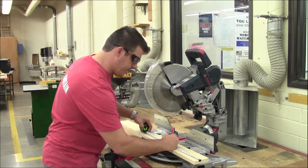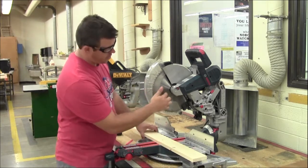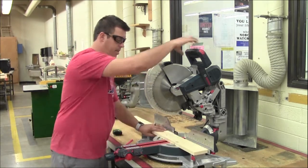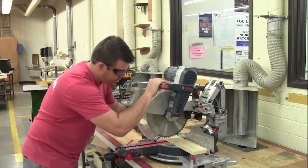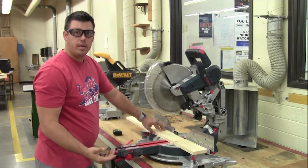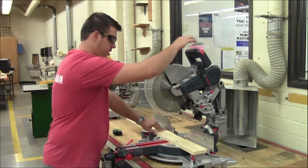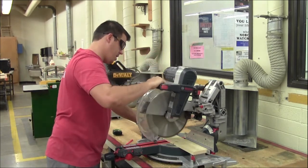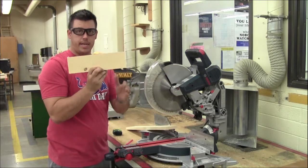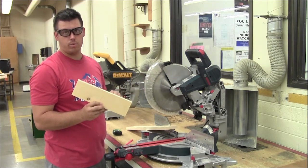One key thing is I'm measuring from the right-hand side of my piece of wood. I need to cut with the right edge of the blade even with the mark that I've made. I'm going to adjust my piece of wood until the kerf of the blade matches my pencil mark. Now I'm going to cut again — firmly down up against the table and up against the fence. Now I have my 12-inch piece, 90 degrees on both cuts. One thing you want to make sure you do is let the blade speed up to full speed before you make contact with the wood.